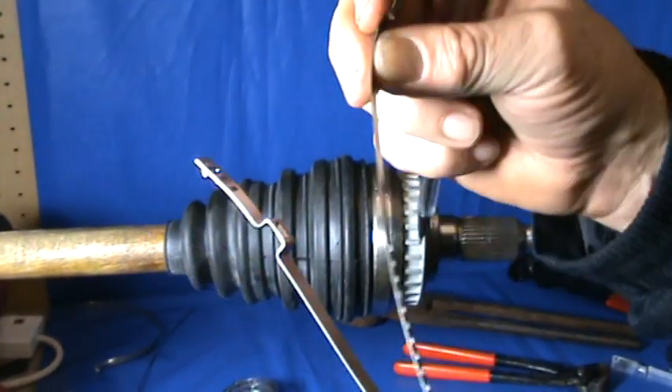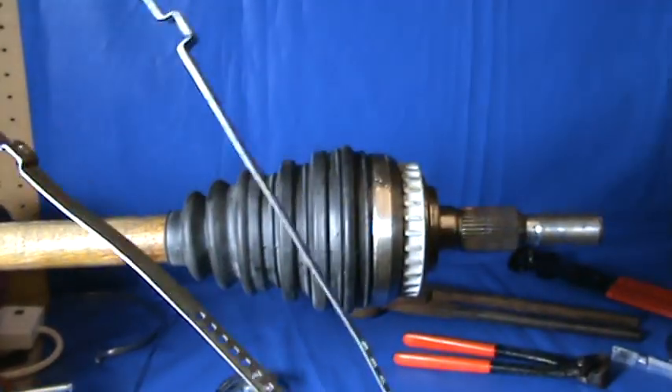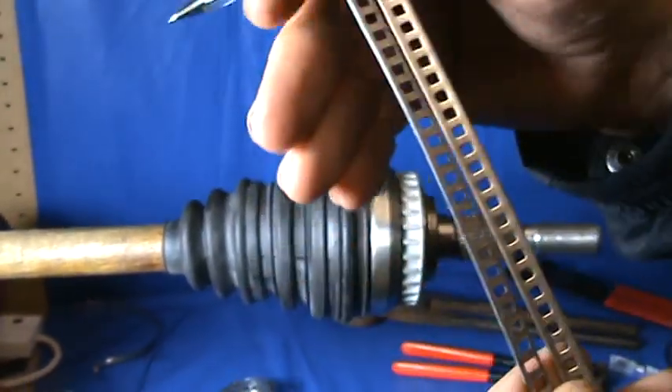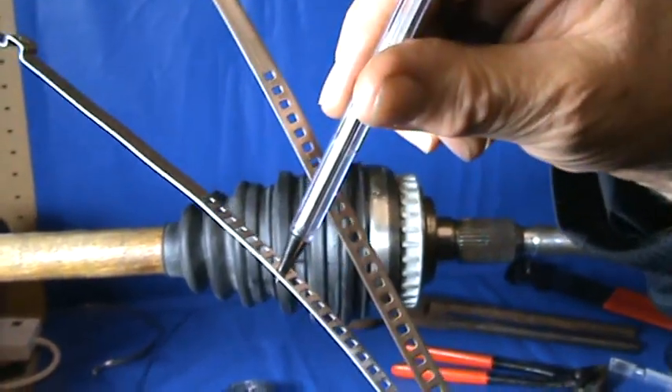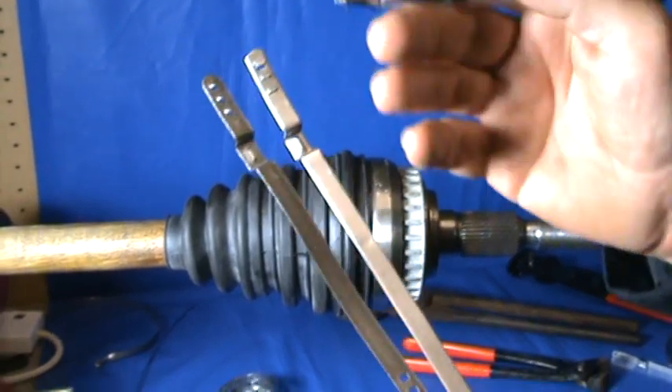This is a cheaper clip — it's 0.5mm thick. This is one from us — it's 0.8mm thick. The holes in them: ours have got bigger holes, which means we've got bigger teeth. The teeth are therefore much stronger.